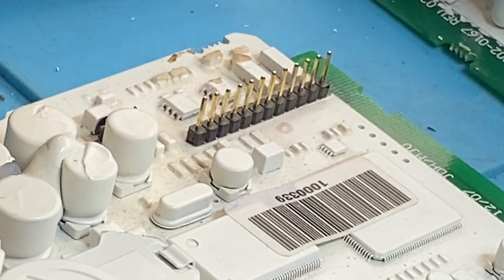a version of Baker clamps on it, which is a diode configuration, high-speed diodes, BAV99s, across the gain resistor back onto the input. So it can't get up near the voltage rails, but it will hit the limit of the diodes, and it can't go past that. That's meant to give it a faster recovery. If you get too much signal excursion, it takes a while to settle things down. Op amps don't like that. They don't like getting banged up against their supply rails.